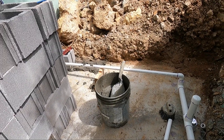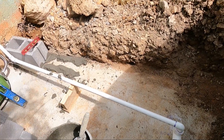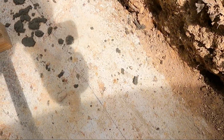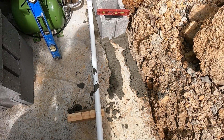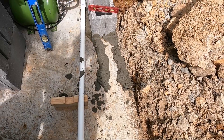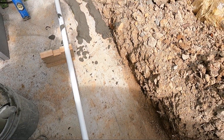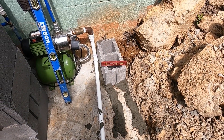Good morning. Today we're going to start working on the back wall of the well house, pump house. I've got my line down — right there is the pencil line. I've got my first block laid. Now I'm going to put the first course in, and I've got to let it set up so I can drill down through the concrete and put my rebar in.